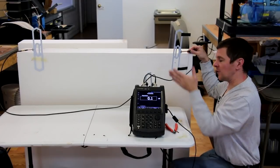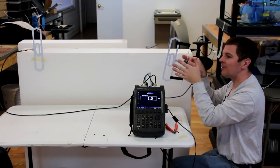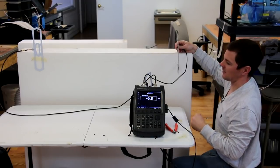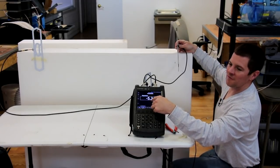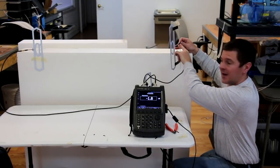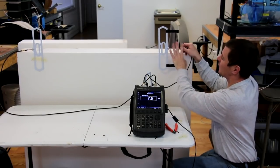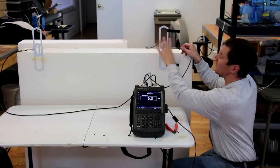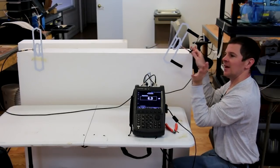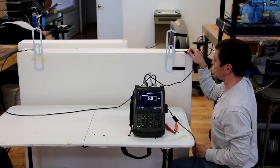So if you stay within 45 degrees to the right or to the left, this is going to greatly increase your range. Your beam width is effectively 90 degrees. However, if you are to the side of the antenna, you'll notice we are 5 dB below where the diamond was without the radiator. That's because this radiator isn't just blocking the signal coming this way — it's actually working in unison with the diamond element to drive the signal forward, taking some of the signal coming out to the sides and driving it forward where you need it. So this is no longer an omni, but a directional antenna.